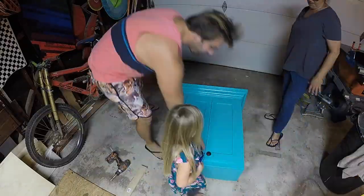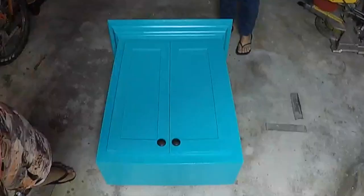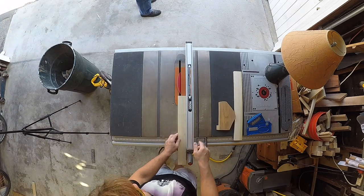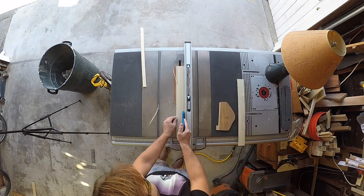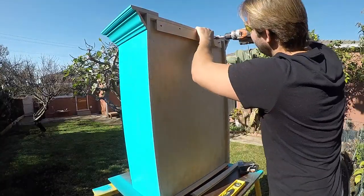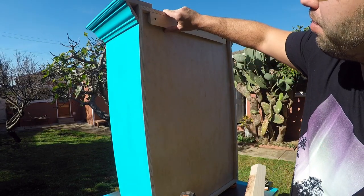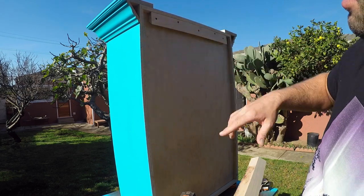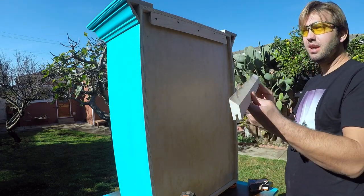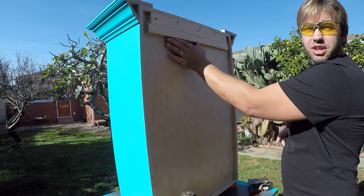All that's left is to adjust the cabinet. I'm tilting my blade to 45 degrees, grabbing two scrap pieces of poplar, and getting them cut for the French cleat. This inside piece is beveled at a 45-degree angle — to the outside I've got another piece of scrap cut with a 45-degree angle. This piece is going to be attached to the wall, and you just go ahead and slip your cabinet on just like that — super secure and easy.